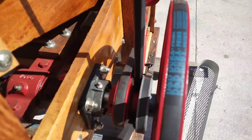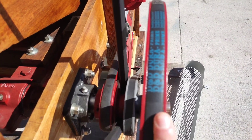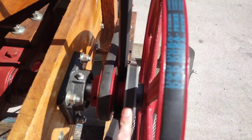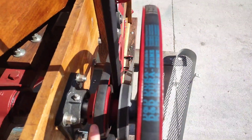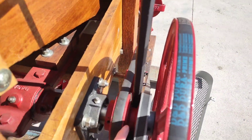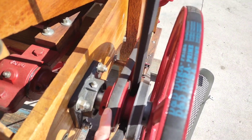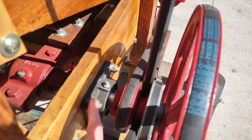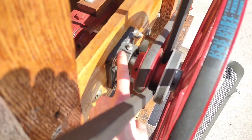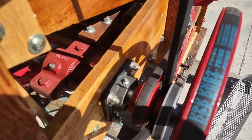This is showing the setup of the pulleys. You have your eccentric drive pulley that is attached to the motor pulley, then the auger drive pulley, and the double pulley system. The smaller one is used to drive the hopper, and the larger one is used to drive the brush system. This is the upgraded 4-bolt flange type bearing that replaces the old brass type bushing that mounts on the side of the cleaner.